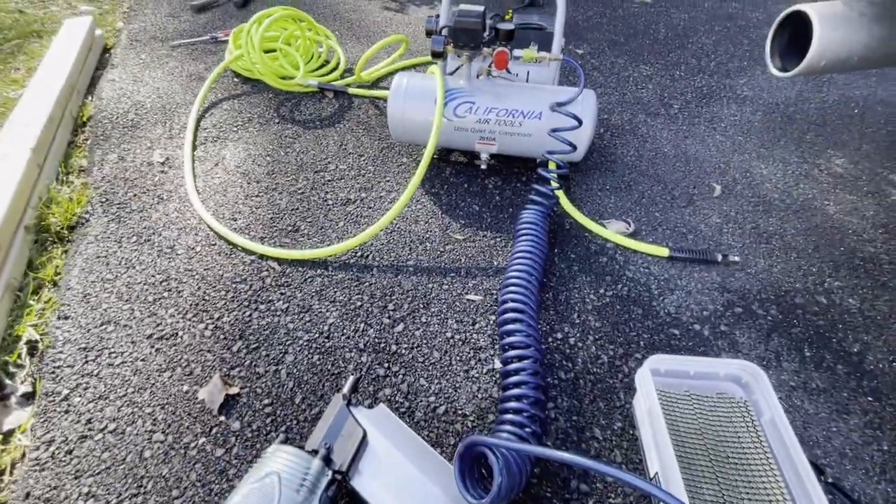From the test it looks like I got pretty similar results — I don't think the hose added that much. It seemed to possibly add one more nail, which could help. This matches my experience doing engineered flooring with it, where keeping up wasn't really a problem. The issue is that the compressor doesn't kick on until pressure drops below 90 PSI, so you take a nail, wait for it to drop just under 90, it kicks on, and then the next nail is at too low a pressure. That seems to be the core problem, and the test replicated that when nailing into the two-by-fours.